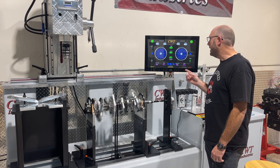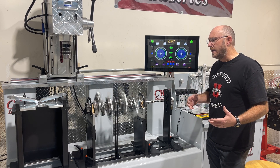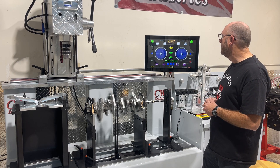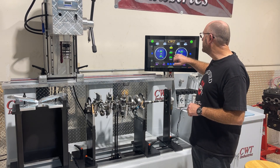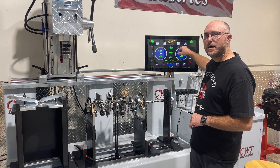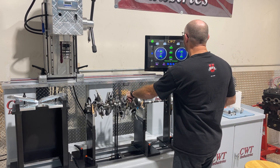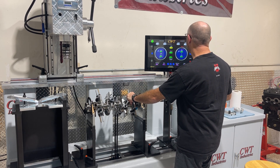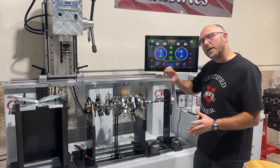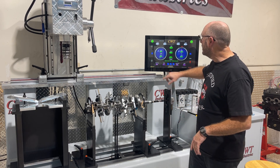Sometimes the clay flies off while we're doing this. I'm going to let this run. Obviously I've been playing around with this and kind of got it close. I want to show you what I mean by having numbers that I can quantify — to say that it's better. So now I'm all the way over here at 0.105. You can see it is balanced to tolerance. I'm only 1.082 grams out of balance on the right side and 1.083 grams out of balance on the left side. And if I bring this up, you can see that it is very well coupled here — 180, 190 degrees. I can play with this by moving that weight around to adjust the coupling.